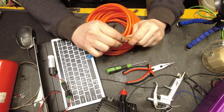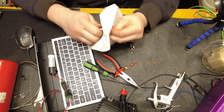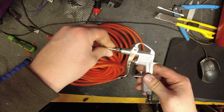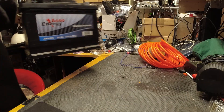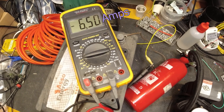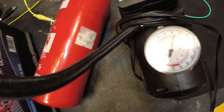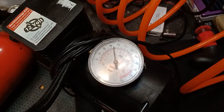In the end I realized that I should have tried to fix something sooner, because in a short time of fixing I managed to have a little compressor set. Of course testing will follow. This time I'm using a car battery, and at about 6.57 amps the compressor fills the tank with 8 bar pressure without any problems.